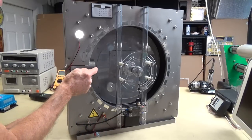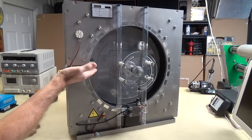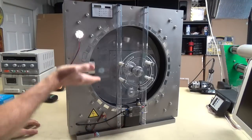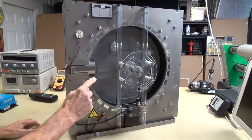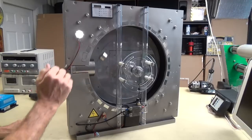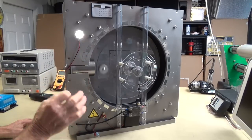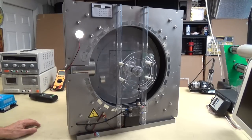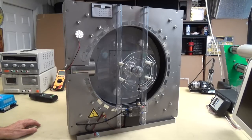So you're just taking a little bit of power just to bump that over, because where it stops and lines up with that electromagnet, that's in the neutral zone. Like I was showing you, it can fall forward or it can fall backwards. It's right in the center. And that little tiny push that it gets from this electromagnet, with that magnet angled the way that it is to make it go only forward, just a tiny little bump, boom, and you've beat that 4%, and around you go, and the acceleration cranks. You should see this under some serious power. I'll probably show it to you.